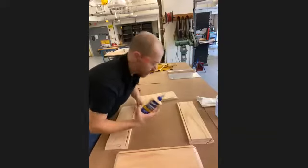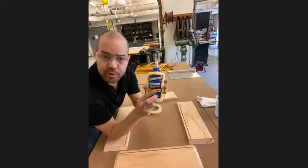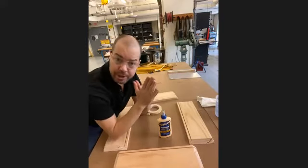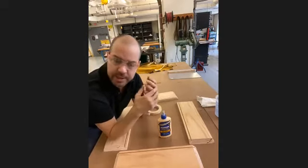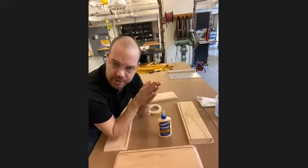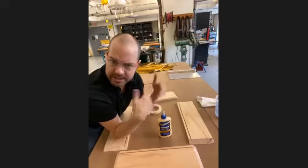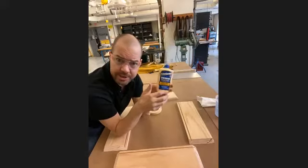The reason that stretch is so important is because you're going to be using wood glue, and the key thing to understand about wood glue is that it is amazingly strong but it only works if it's between two surfaces that are perfectly mashed together — no gaps, nothing, just perfectly edge to edge. It is an aerobic glue, meaning it cures when exposed to air, but only when it's very thin and squished between surfaces. This is in contrast to an anaerobic glue like a resin, or UV glue which requires UV light to activate.